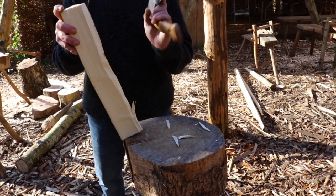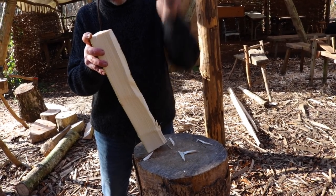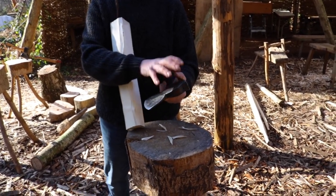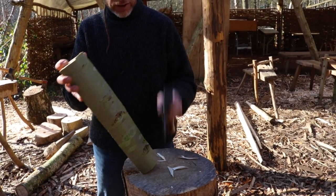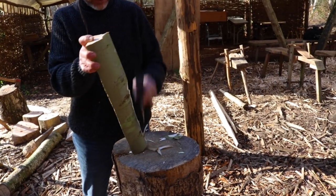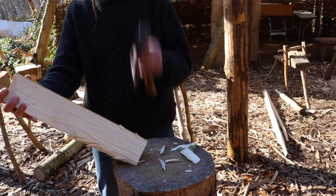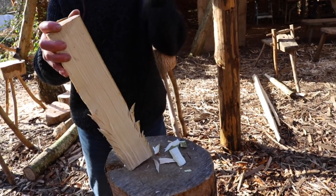Keep a loose wrist so that when you let the axe drop down, you're holding it lightly — using the weight of the axe to throw into the wood. Let the axe go straight up and down. If you come in at an angle, you feel the weight in your hand and all that power goes into your hand rather than the hit. If you just let it drop down, all the weight goes into the cut. I'm just taking the corners off, turning the billet, and angling the piece to get the correct cut. If the wood is too vertical it misses; if it's too angled, it doesn't cut correctly. Bring it to the right angle and you can hear it cuts just right.